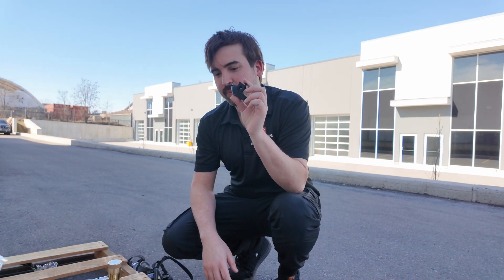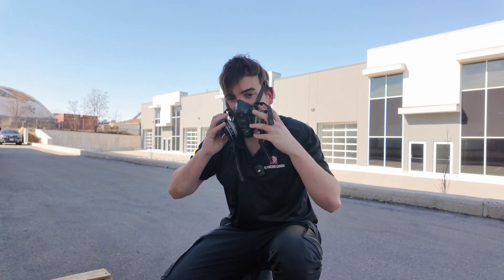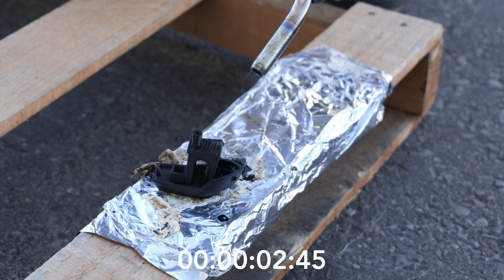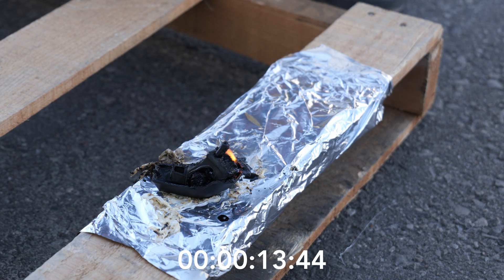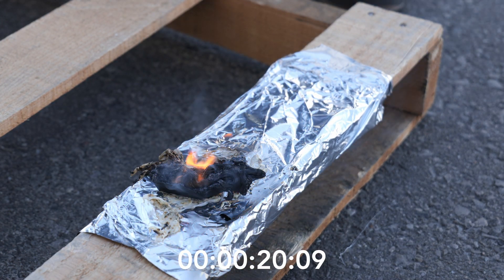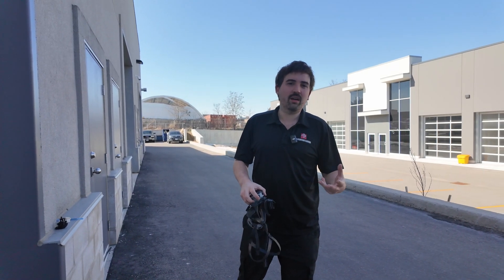And then finally we have PC-ABS FR0. This one is designed to be the most fire resistant of all the ones we've done. It shouldn't melt as quick either. For this one, there is some toxicity to it, so I'm going to wear a respirator. I think that one did last a little bit longer than the PETG. You also notice it did light on fire, but it did extinguish itself. I think it had to get hotter before it did combust like that.